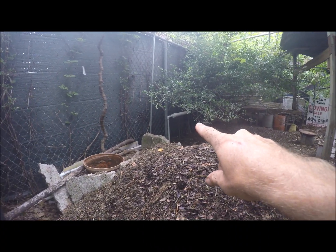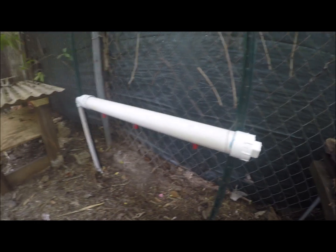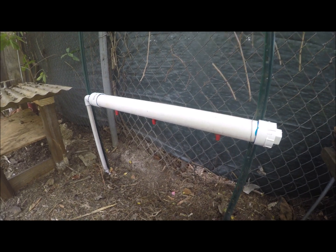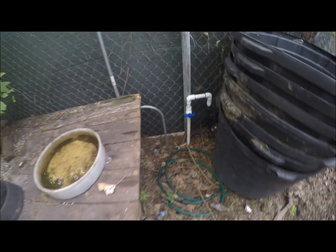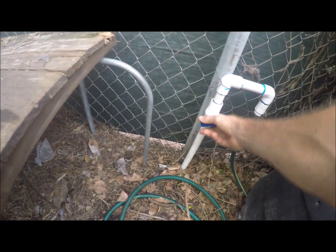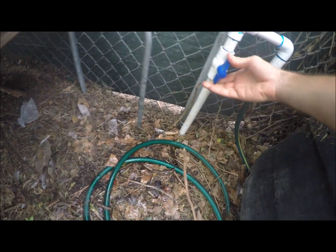The nipple waterers — I put a set of two there and another set of three here. You need an 11/32-inch bit for nipple waterers, and that's in two-inch PVC. It's all threaded so it can be cleaned out and taken off. This is the hose — the pots can come out — so it's got its own bib. This is going to be huge for just being able to rinse out food dishes and stuff. It's pretty low pressure right now, but still handy to have it in the run.